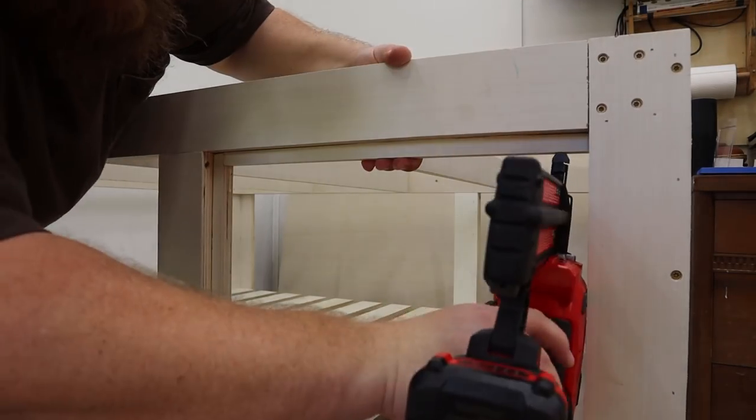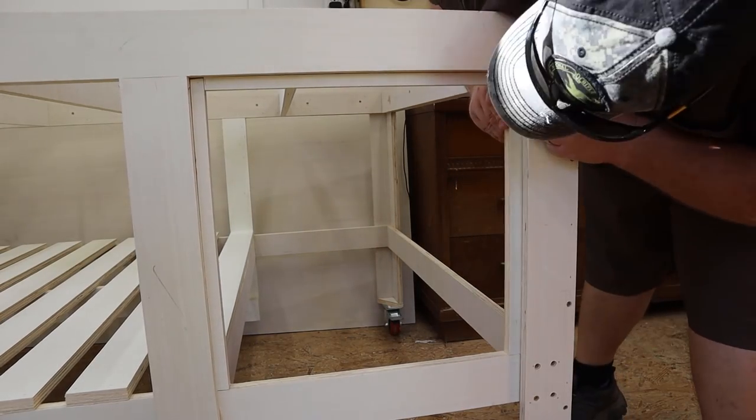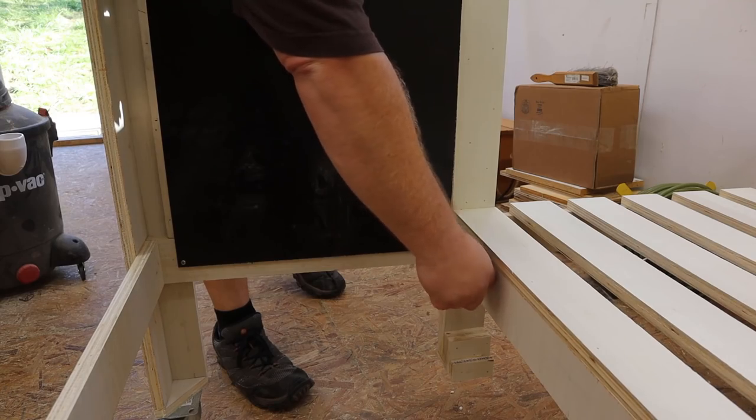You might be wondering why the middle leg of the table is not centered left to right. I did that for two reasons. One, having a larger shelf over to the left allows me to store large sheet goods for the CNC — it didn't make sense to build a machine that could cut a 33-inch wide piece but have a shelf that couldn't hold one. In addition, it also gives me a smaller area where I can insert a panel as a mounting surface for my emergency stop switch, other controls, possibly a variable speed regulator — think of it as an onboard breakout panel for any customizations you may add to your CNC in the future.